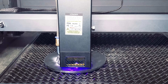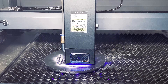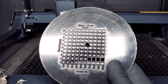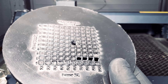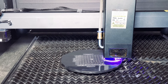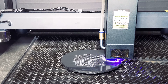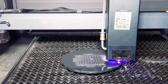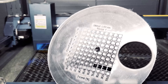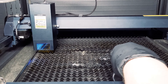We did so well with acrylic, so let's see if HDPE can give us a good result. From our HDPE engraving test, we got some very good potential. We did a circle cut using multiple passes to see how this material does, and the cut test went surprisingly well — we have a very nice edge and no melting.